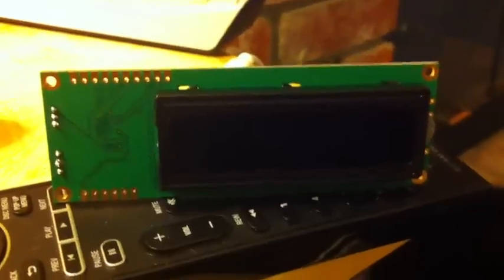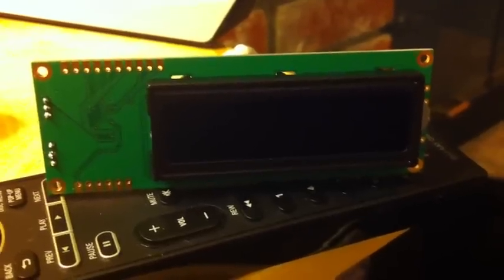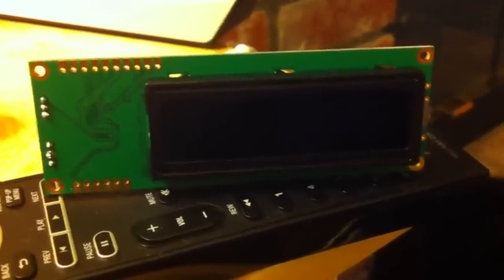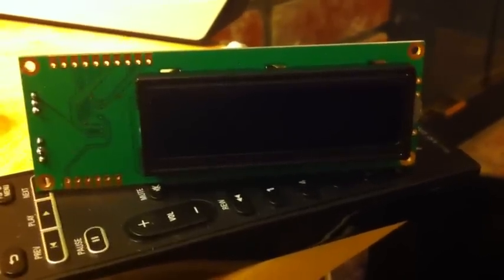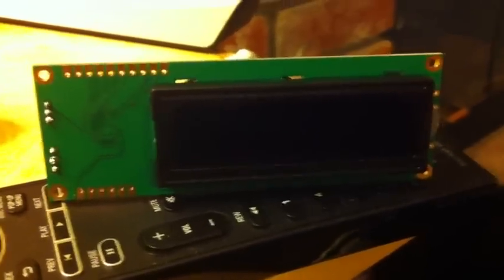It's pretty simple. Hooking up LCD modules isn't really difficult. The normal way to do it, most of these are based on a Hitachi HD44780 chipset, and there's tons and tons of documentation — indeed, the Arduino comes with a library that you can use to interface with these, so all the software's already been written.